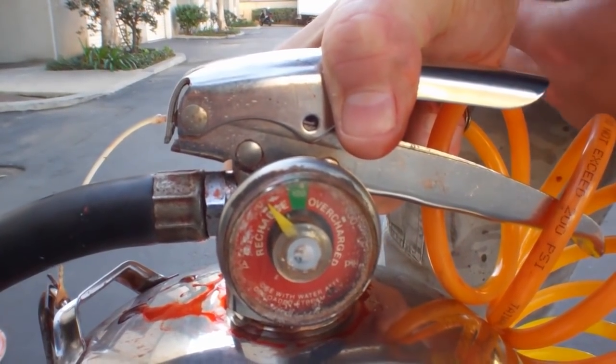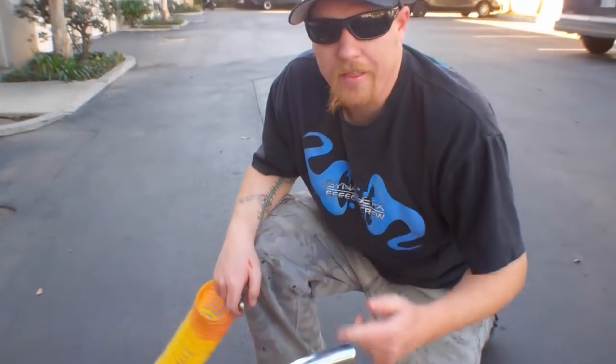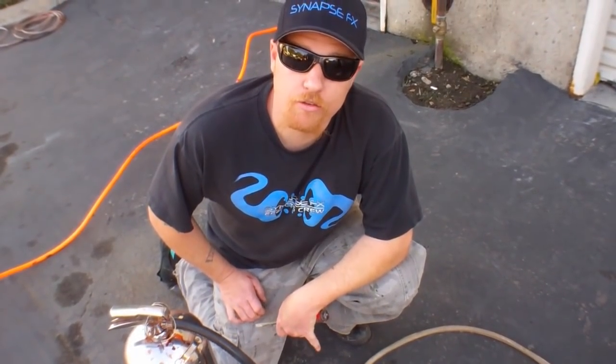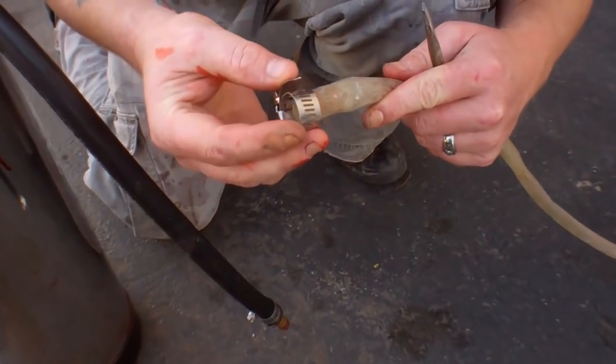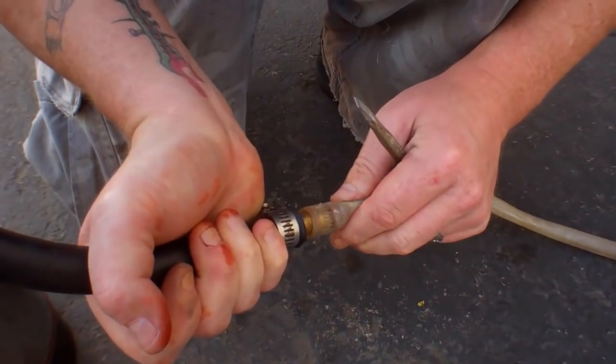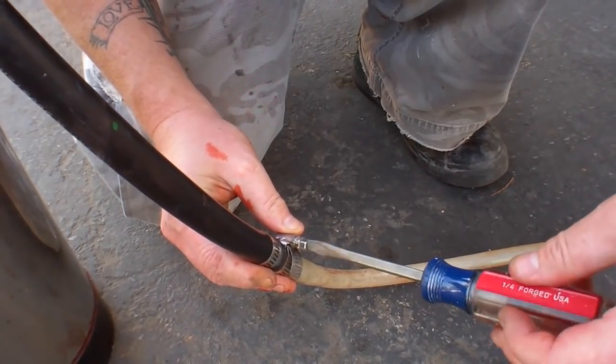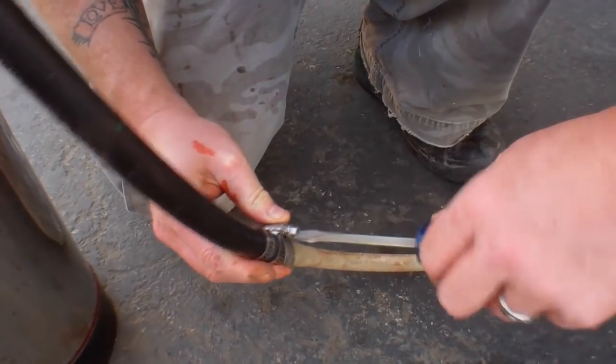You can hear the bubbles rising inside through the liquid. Now that should be just about perfect. What we're going to do from here is hose clamp the vinyl tube to the extinguisher and connect those two sides. You can find a pressure extinguisher on eBay for around 30 to 50 bucks — they're relatively cheap. We like the hose clamp because it's nice and tight and stronger than a zip tie. There's a lot of pressure running through the extinguisher, so you want to make sure your two hoses don't pop away from each other.